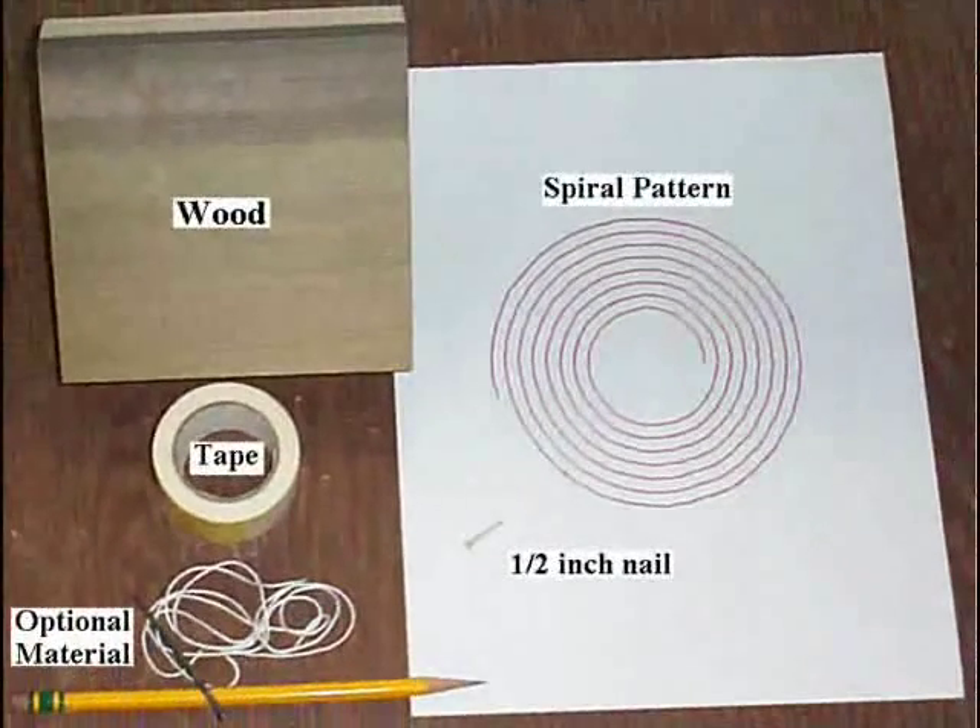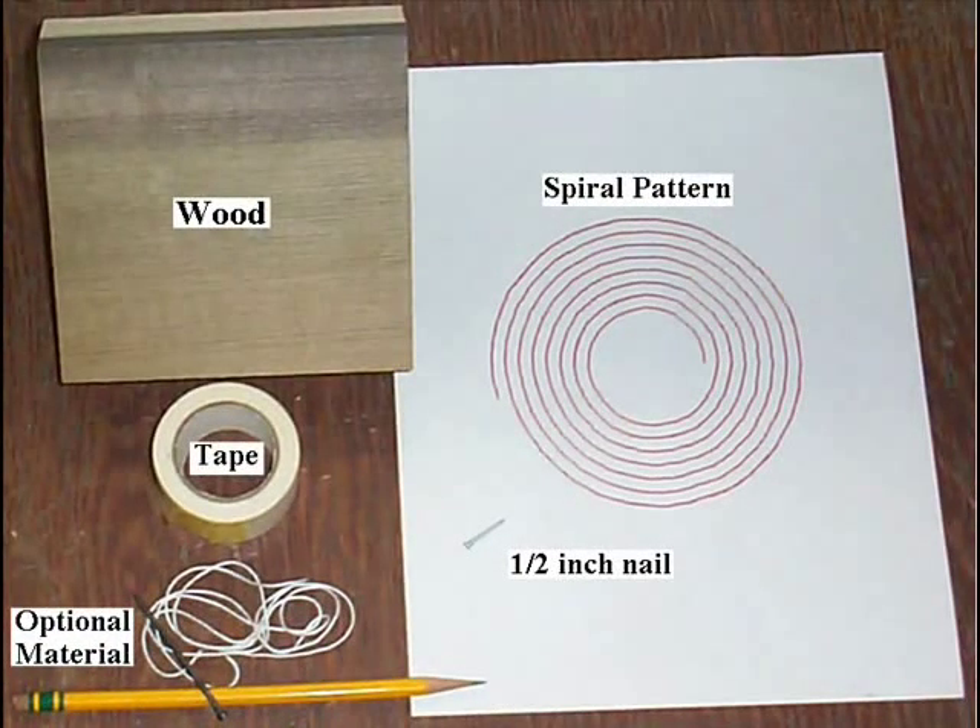There are some materials you'll need before you start. You'll need a solid board at least three quarters of an inch thick and about five and a half to six inches square. When choosing your wood it's better to use a tight grain wood such as mahogany. This will make your bowl less likely to split when expanding and collapsing it. Practice with scrap wood until you're sure you have the results you want. Save your good board for the final bowl.